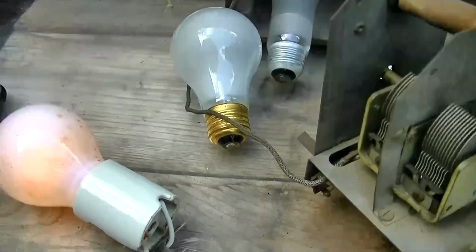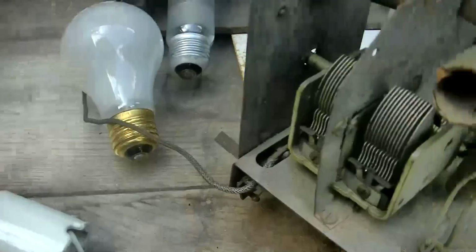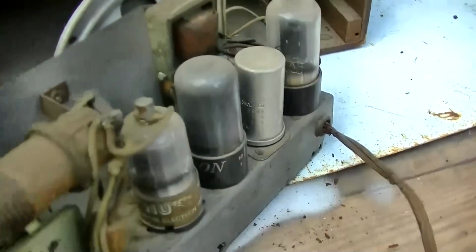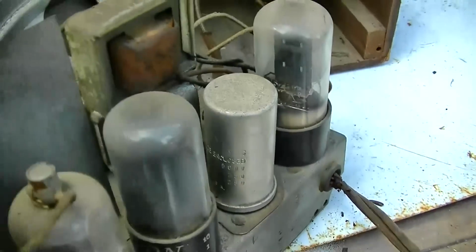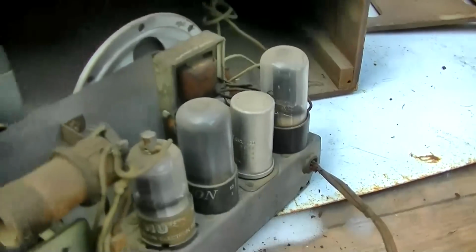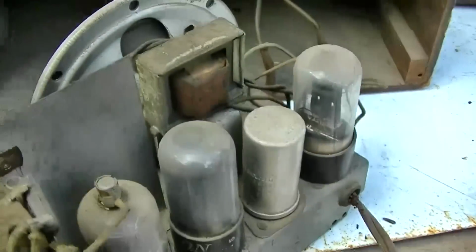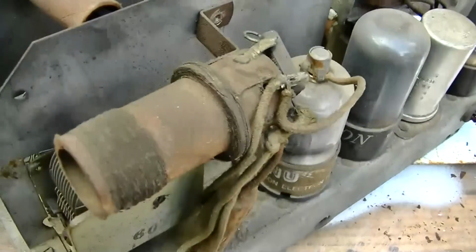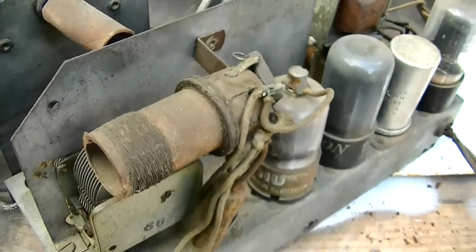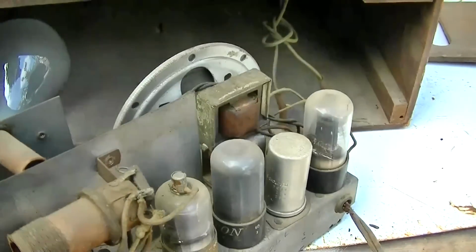Interesting. So this switch is this a 35Z5? You know, the rectifier tube acts like a fuse in these, so if something shorted, it just blows the rectifier tube apart, and I would rather not do that if I could avoid it. Ooh. TRF set should get KNX.